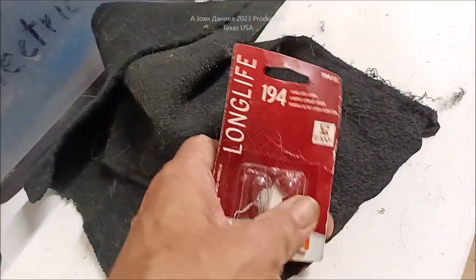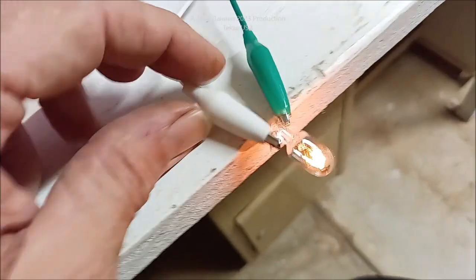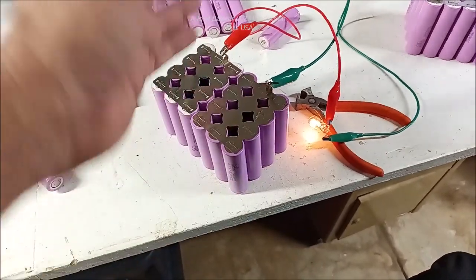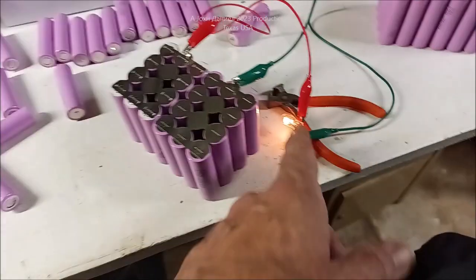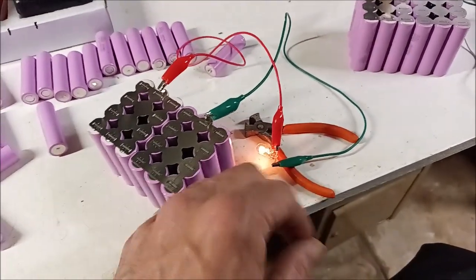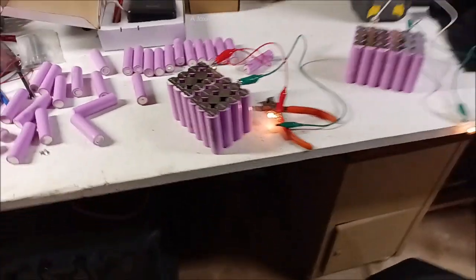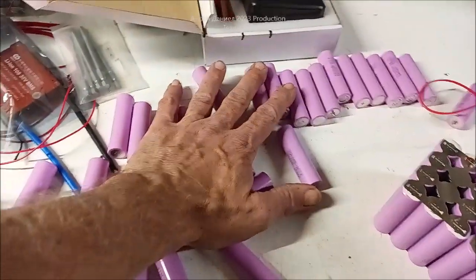Look at what she's achieved — this is exactly what you should do. You just find these on any convenience store shelf, they're standard signal lights — T10 style. They will effectively drain down a battery from roughly 18 volts all the way down to about 4 volts. They'll still pull down to zero practically, but they completely black out at about 4 volts — so you can tell when they're done when they dim out. This is what she's doing, and it's for a battery bank or battery pack.